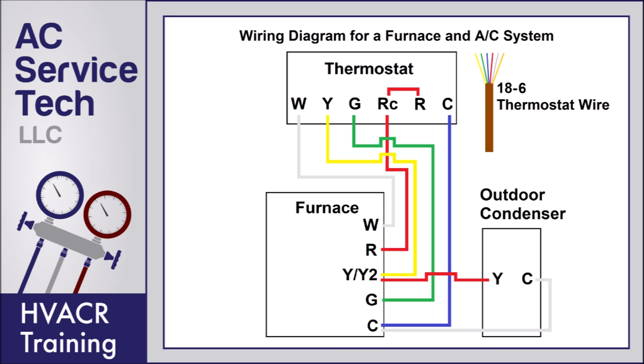In this case we needed five wires, and we typically run six to the thermostat just in case we need to swap one out. You may have eight wires or fewer, and they may use different colors. So always make sure that if you're going to replace the thermostat, you turn the power off to the furnace and look inside to see which color wires are connected to which terminals. You can also take a picture of the thermostat terminals before disconnecting the old wires.